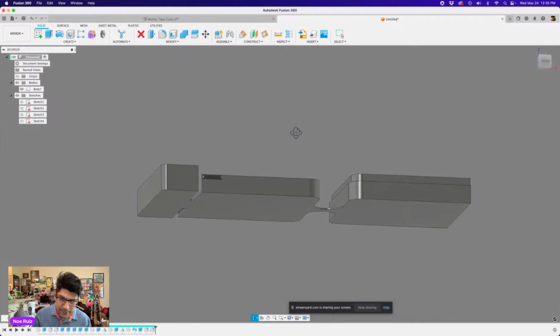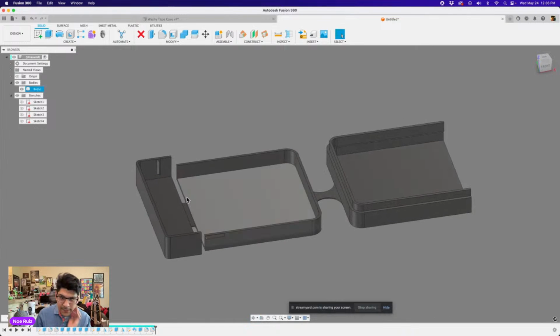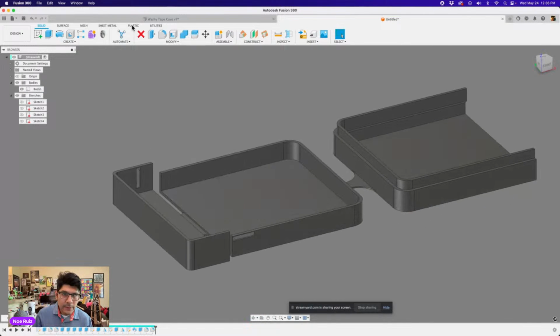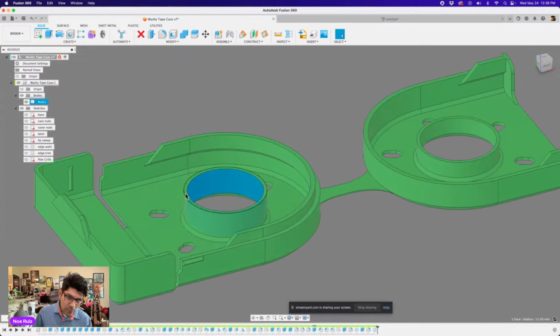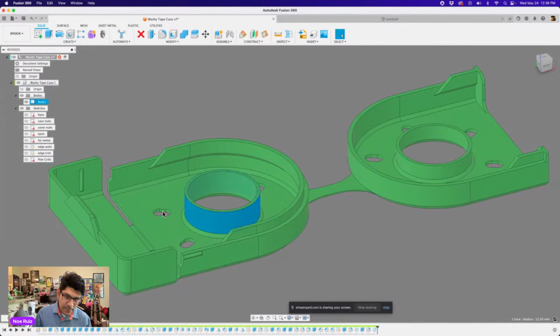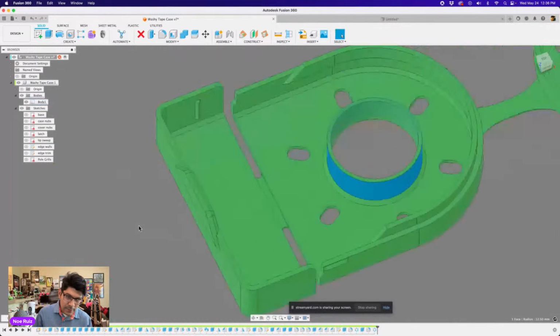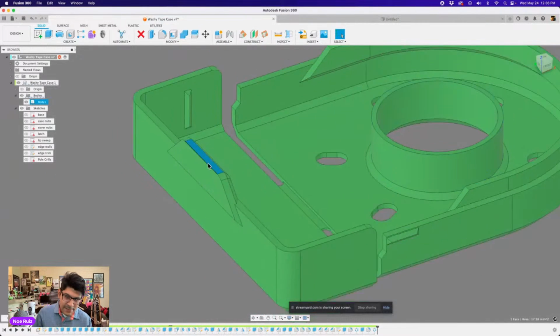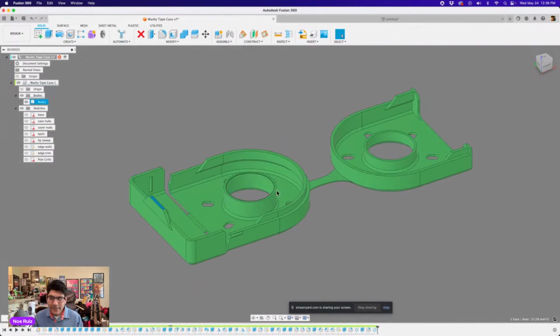If you're using an FDM printer, again, you want to use a layer height of 0.2 millimeters, which is pretty common. But everything here is pretty much the same as this washi tape one. There's just a bigger extrusion, and then there's a center hole with the cylinder to hold the tape, and just some circular pattern grills here. And also that little lip, that little latch to help you open it up. But you really don't need it. It's just for aesthetics.